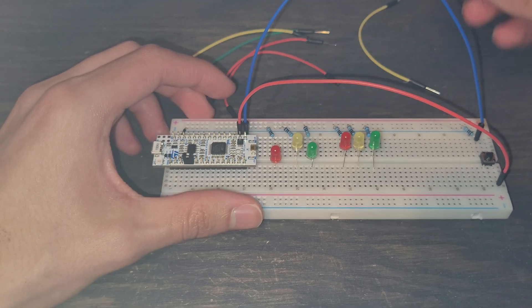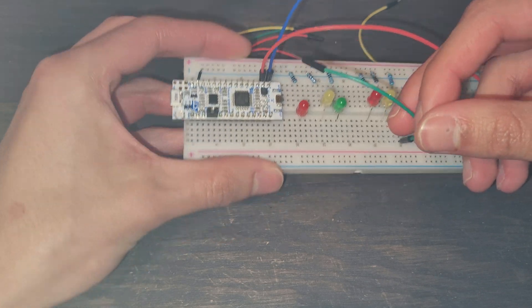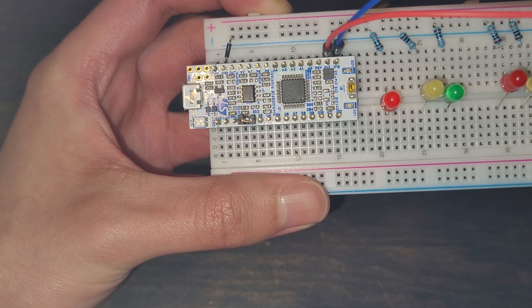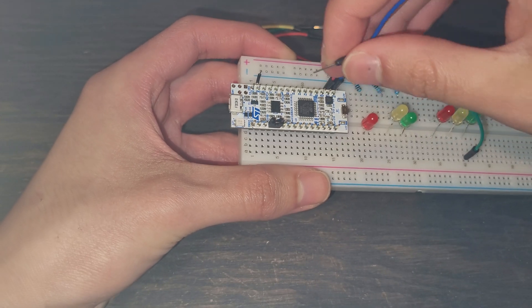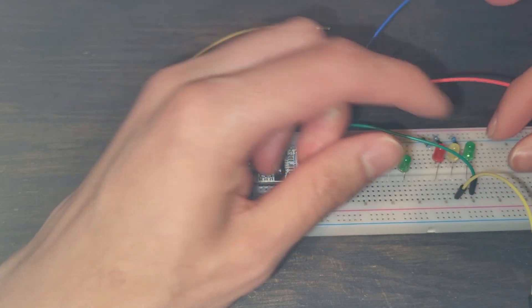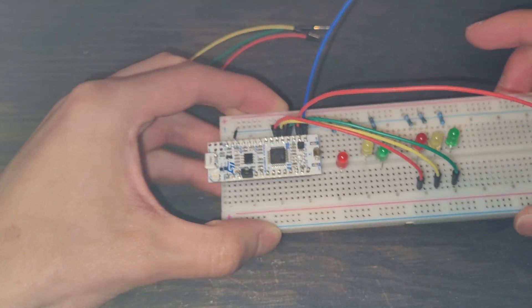Now let's wire up the output connections. I'll color code the wires. The super easy pins I'm going to use on the top side are A0, A1, and A2. This green wire goes to the column of the green LED and connects to A0. Skip the middle REF pin — we don't need it. The yellow wire plugs into the same column as the yellow LED and goes to A1. The red wire connects to the red LED column and goes to A2. Check all connections to make sure they're correct.